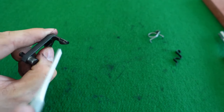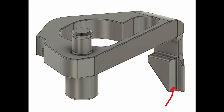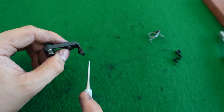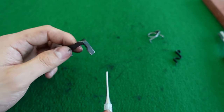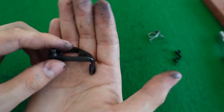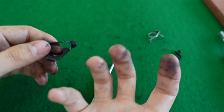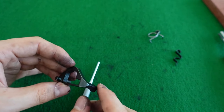On the ejector you have what I call the passive extraction beak, which serves as an extractor when you want to manually withdraw a round from the chamber. Normally during the cycle of operation the case extracts itself, so you don't really need to make the ejector very strong for extraction — contrary to other designs such as the AK assault rifle, which do have very strong positive extractors. This is not the case on the Stürmgewehr 57 simply because it is not required by virtue of design.